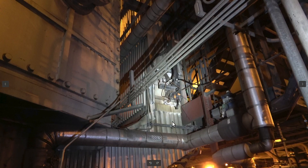This is part of the air control. Here's the PASO — primary air shutoff damper. Up here we have the sweeping steam valve feeding in, going down to a trap. The inerting steam comes off a little higher. So this is one of the dampers on the boiler for shutdown — the primary air shutoff. From here the air is coming down and going into the pulverizer.